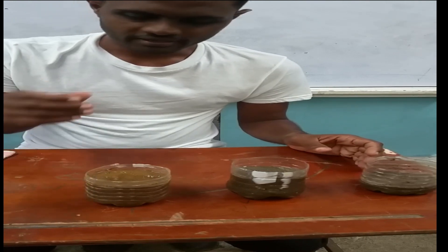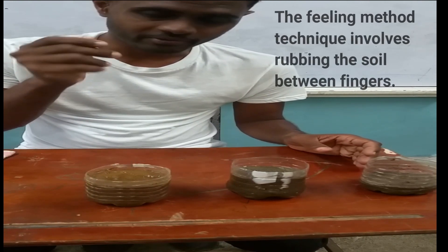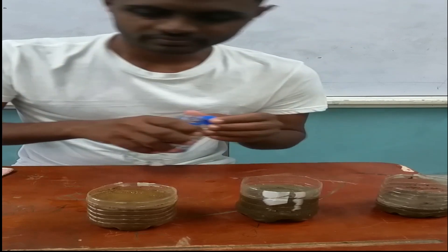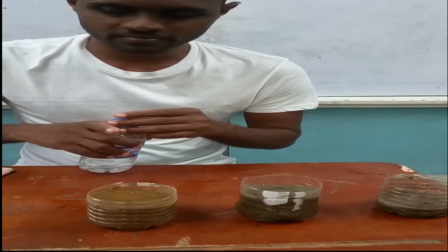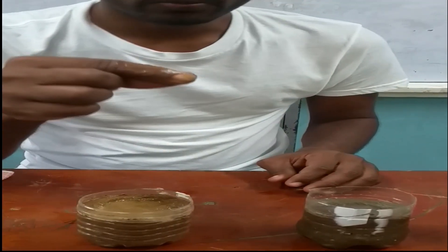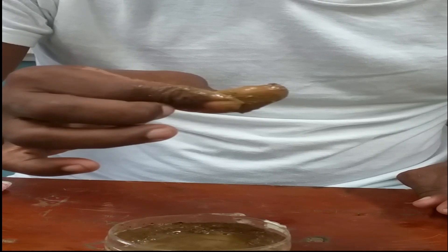When carrying out the feeling method, I basically feel and rub the soil. I first wet the soil sample, then take it up and rub the soil using my thumb and index finger. I can feel some grits in the soil, so it has some sand. It also feels smooth. Making sure I can feel all the particles — this type of soil has sand and silt. It has more silt in it than sand, so this soil is a silty soil with some sand in it as well.